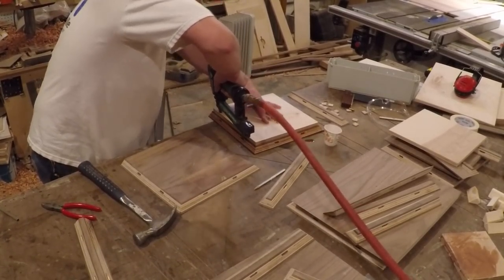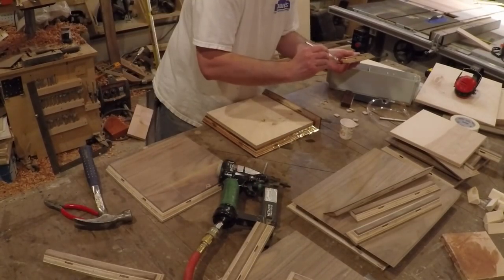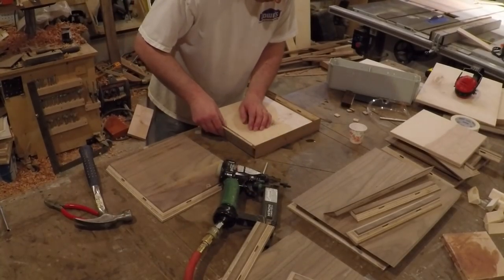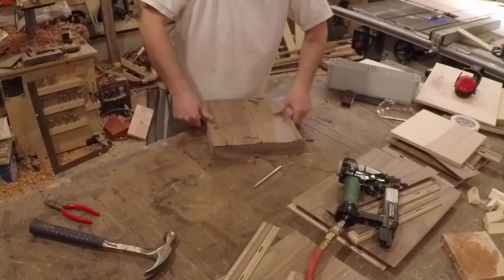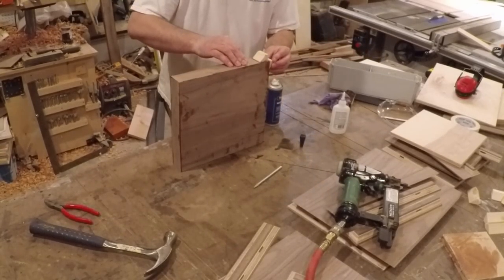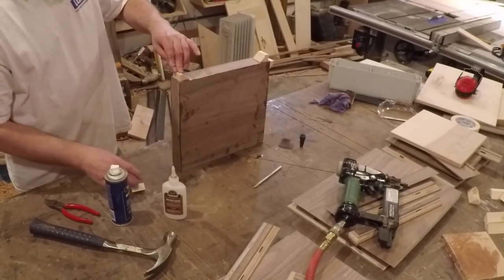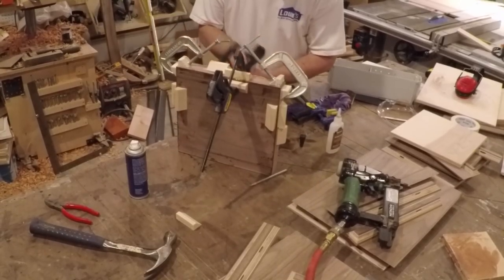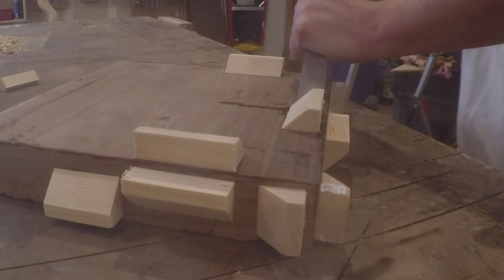To bring the inside of the shelf to the right thickness and give me something to screw into when installing the shelf on the headboard, I glued and tacked in place a plywood filler strip. Then I started applying the glue and dominoes to all the surfaces as I worked my way around the shelf. Once I had all the parts in place I used some CA glue along with glue blocks so I could pull the miters tight with clamps. I used a slow setting epoxy for this glue-up so I had plenty of working time to make adjustments and ensure tight miters on all sides. I did the same process for all four shelves.